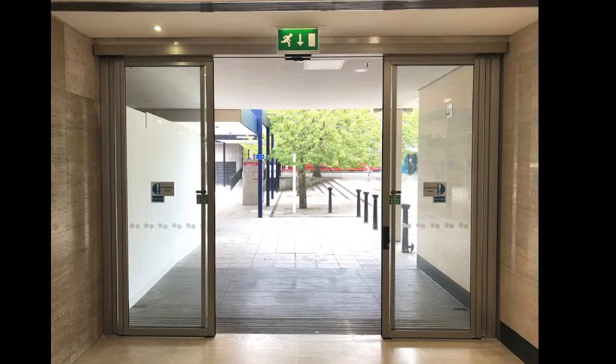So let's consider the foot button as the button which is connected to pin 1.0, and the buttons over here pin 1.1 and 1.2. So when the door is opened, the button will be pressed from here and here as well. So 1.1 and 1.2 will be activated whenever the door is opened. And whenever pin 1.0 is activated, it means that there is a guy standing over here, who is pressing the button. So the door is opened in this case.